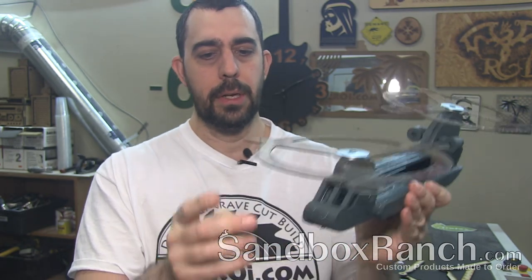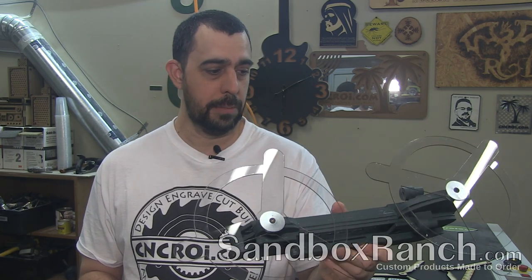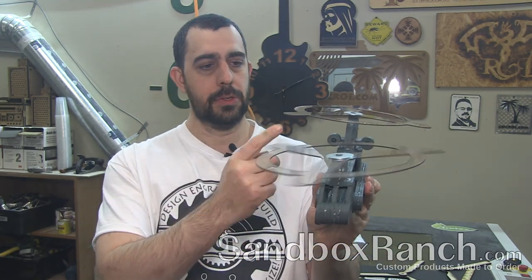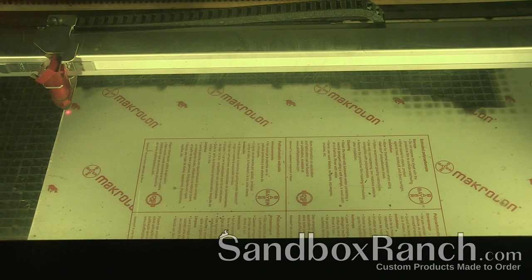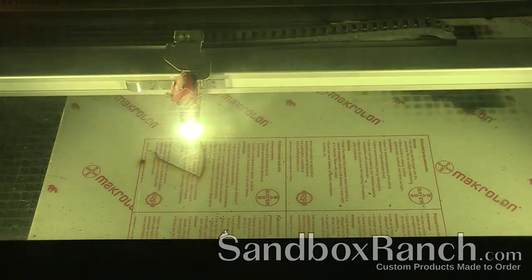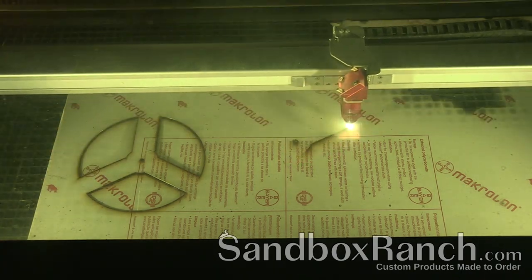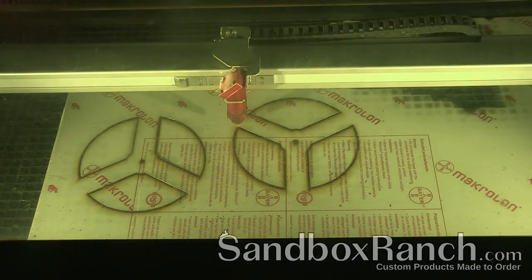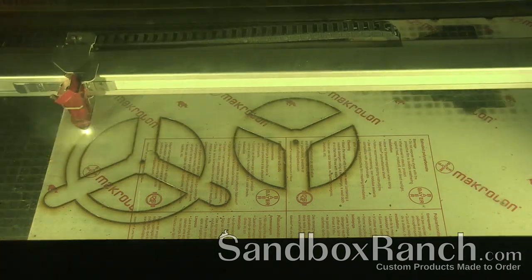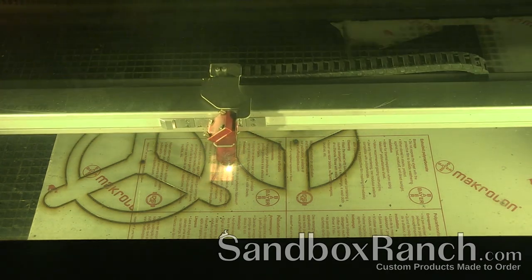The new design is much fatter and rounded, so even if he hits himself with it, it's far safer. So far he's loved this helicopter and was crying when he broke the first one, but I told him I'd make him a brand new one and now he's got it. I've cut a lot of polycarbonate with my laser and router — it's a nasty material when laser cut. So I wiped all the edges before assembling it onto the finished model, so even if my son chews on it a bit, the nasty residue is mostly gone. If I observe him going at the edges too much, I'll just sandblast the whole thing.